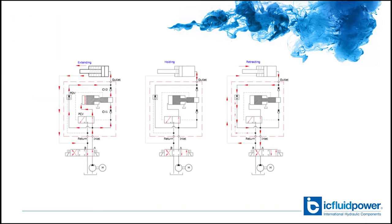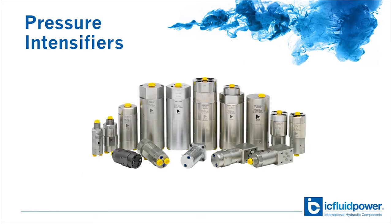An important point to remember is that when using intensifiers, you will initially have the full pump flow supplied to the high-pressure side — to move a cylinder rod into position, for example — and after the pump pressure has been reached, the intensifier automatically kicks in and increases the pressure to the cylinder. That's it. By placing an intensifier in your system you can get the power you need without having to redesign or increase the size of your system.